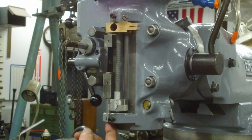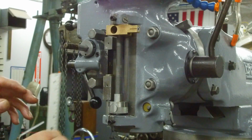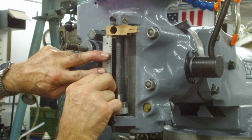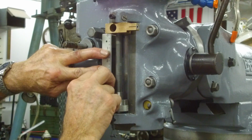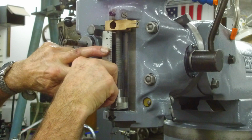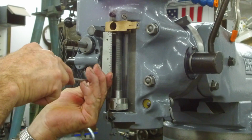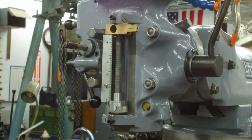Okay, we dropped our pin back down, and so we could drill and tap through there at 8-32 because the 6-32 was worn out from short screws and some other things being in there. And we drilled out the hole in our scale to match. We actually kind of reamed it. And let me go ahead and get my screwdriver in here. There we go. Okay.